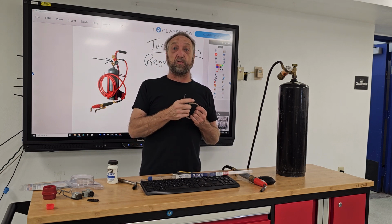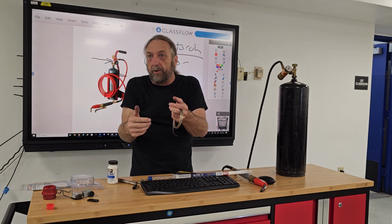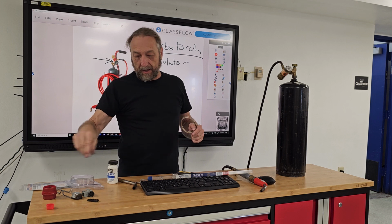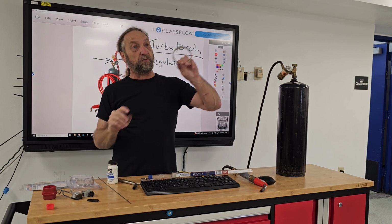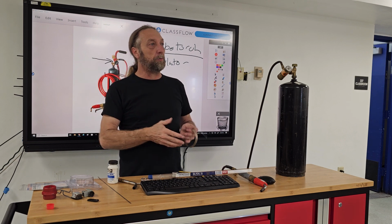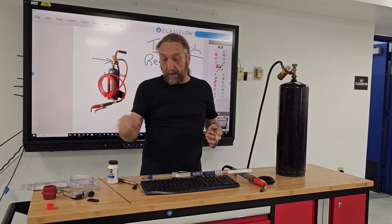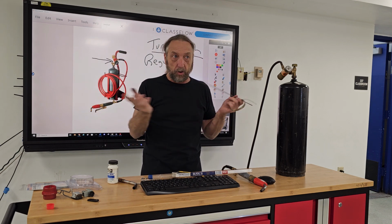It is easier to flow, so if you're doing a compressor job and you're doing a line all the way in there, you probably want to use the 45 because it takes less heat and it'll be easier for you to braze than this rod here, which is going to take more heat to stick. A lot of times we use the 45 when we're brazing copper to steel, because when we're brazing dissimilar metals, steel needs more heat than copper for the solder to stick to it. You can use 15, don't get me wrong. I've done complete compressor jobs with a 15, no problem.